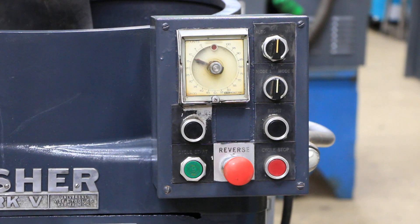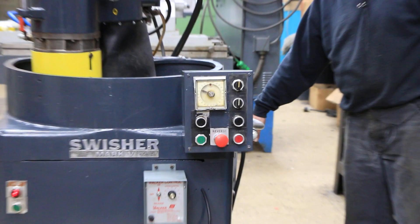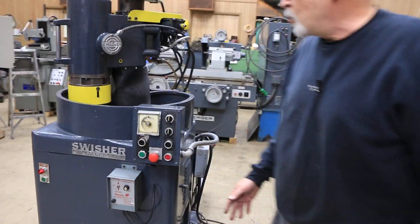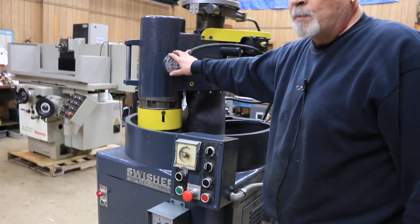The basic voltage of this machine is 220 volts, three-phase. That's the main power, and everything will be marked on here — the main power that goes into the disconnect box. That 220 volts is only really used on this machine to run the grinding spindle.